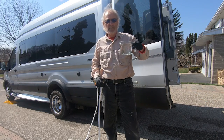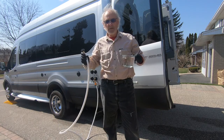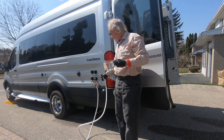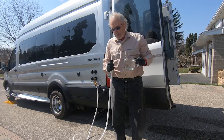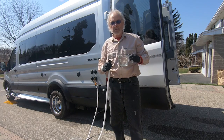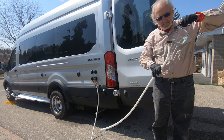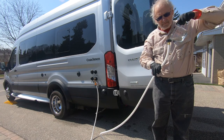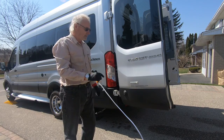I put about 125 ml, or a half a cup of bleach, into a measuring cup and diluted it with water. I'm going to pour it into the potable water hose so the hose can get some sanitization as well. That hose is attached with the pressure regulator and into an elbow to keep the strain off the attachment point. Deanna is going to hold up part of the hose while I attach this end, and then we'll turn it on and fill the fresh water tank.